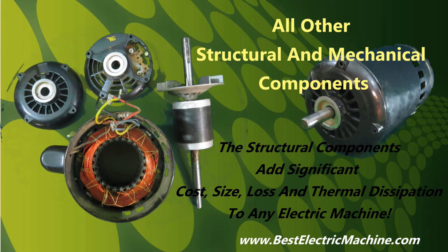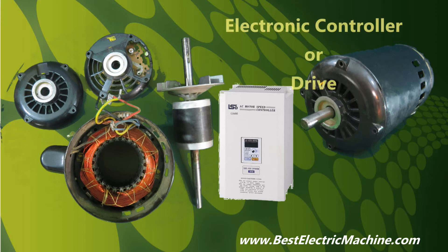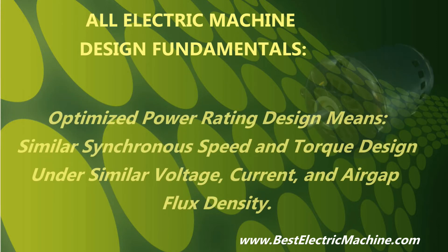As a fifth and increasingly critical component of any electric machine system, electronic control of the current, voltage, and excitation frequency of the active winding set is now commonly used to at least implement practical operation of the electric machine, such as for the permanent magnet, reluctance, or doubly fed electric machine, or to tune the performance of any electric machine between the dynamics of the application and the electrical environment. Note, the electronic controller or drive of any electric machine compounds the loss, cost, and size of the electric machine system, and as a result, should be equitably included in the overall price performance calculation of any electric machine system. Still, it is expected that all electric machines will be electric machine systems in the near future because of significant improvement in application performance, such as varying the speed and torque to match the load, or ultra-high speed operation for higher electric machine power and specific density.